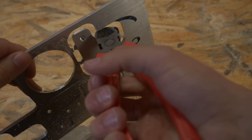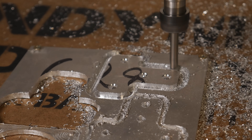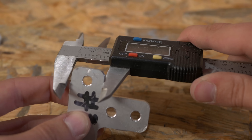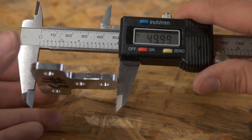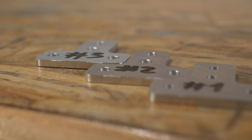The first milling with the new bigger milling bit was successful and already a better result than the first attempt. I measured things, changed some settings in Fusion 360, and tried again. This time we have a pretty nice result and the dimensional accuracy is almost perfect. When you compare the surface finish on the first piece to the second and then the third, the third one is just the best and the dimensional accuracy is almost perfect. I still have to experiment a little more with aluminum and maybe some different metals, but for now let's jump to the last thing I milled on the IndieMule.